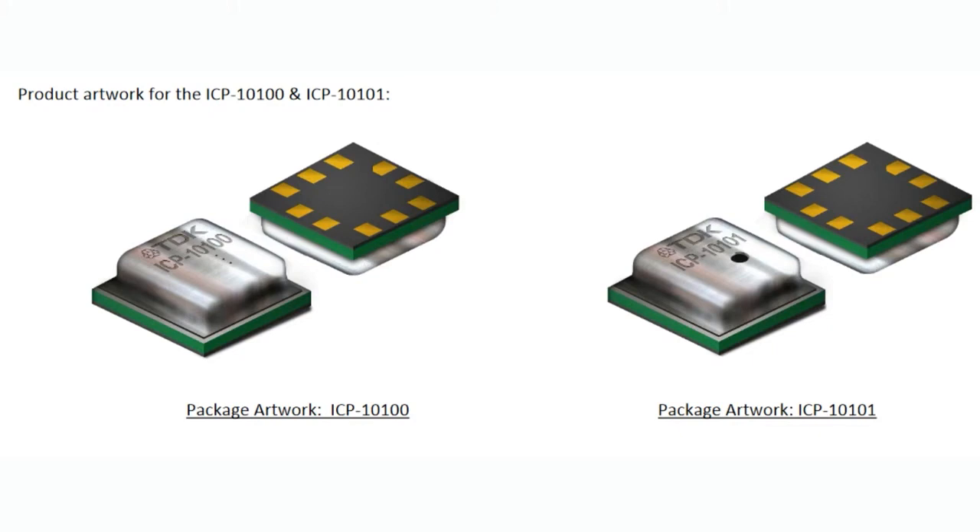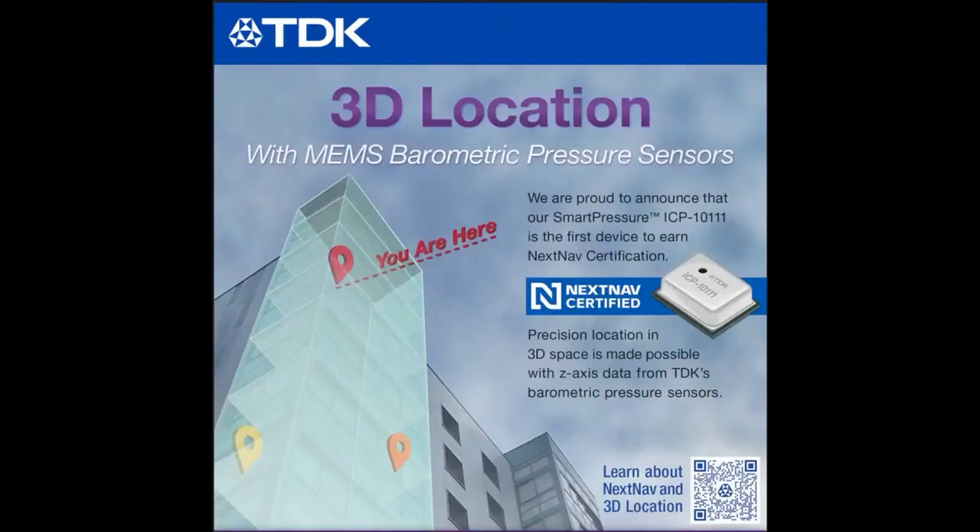It's IPX8 rated, which is really good for a sensor that does barometric pressure sensing. TDK is really promoting this for mixed use with a GPS sensor — use GPS to give you your latitude and longitude. GPS does do altitude as well, but GPS is only good to plus or minus 5 to 10 meters, so you're not going to get very precise step-by-step altitude measurements. And of course, indoors it's even harder to get a good GPS fix — you might only get a 2D fix — in which case you could use a barometric pressure sensor, which works all the time indoors, wherever, even underwater, and uses a lot less power than GPS.